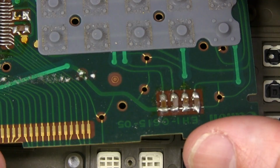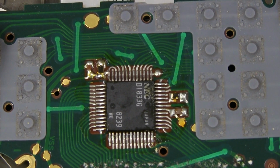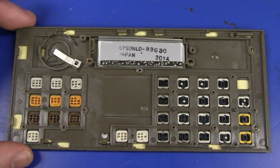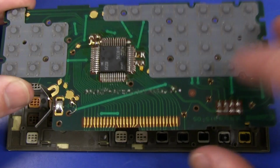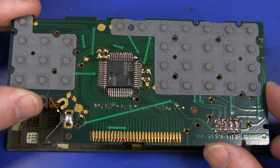Check out the soldering on those surface mount caps. That is crusty as unbelievable. And surrounding the chip there isn't any better. Look at those couple of chip resistors and chip caps there. Oh, awful. We have ourselves a Japanese Epson LCD display there. And there's not much else in it. These things are always very simplistic. Custom ASIC manufactured by NEC. That looks like a fiducial there. I don't know why they need a bloody fiducial on this thing. Machine assembled, my ass.